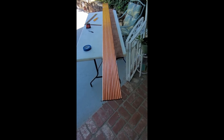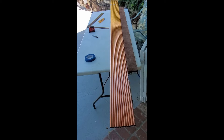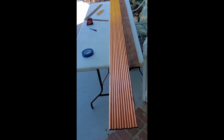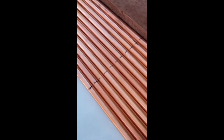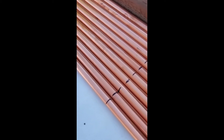This is our copper, sold in 10-foot lengths — 120 inches divided by three comes out equally to 40 inches. We marked all of them at one time to make it easy: 40 inches here and another 40 inches here, and then we went ahead and cut them, knowing we already had a mark.